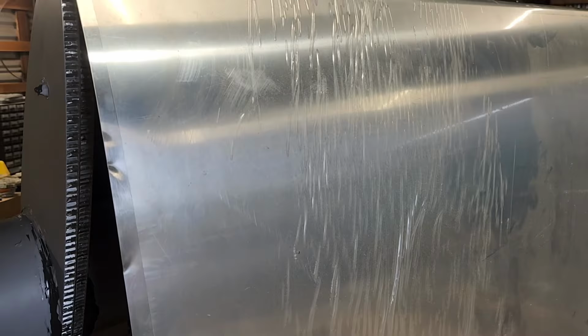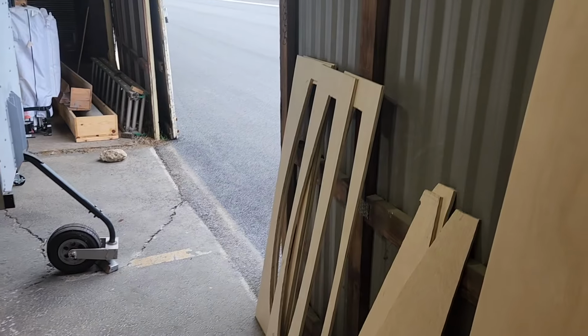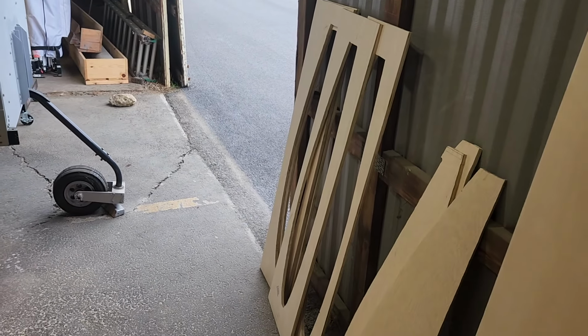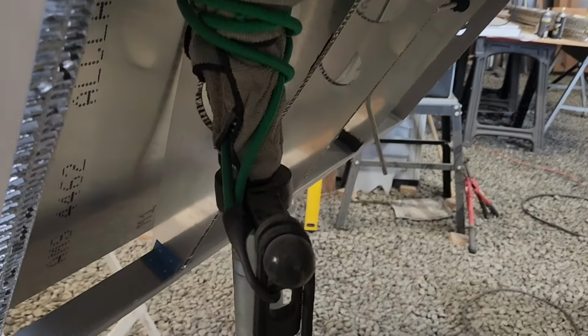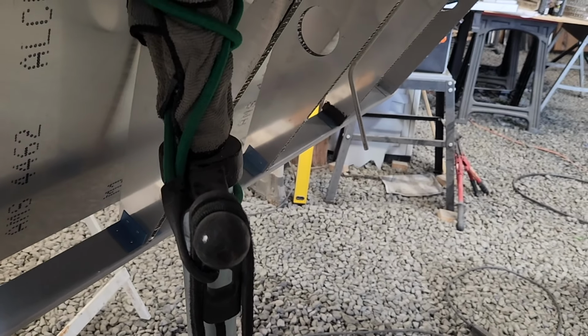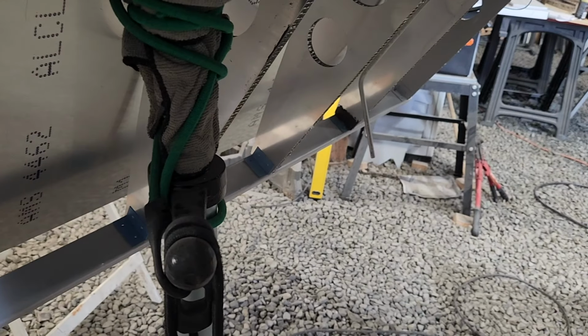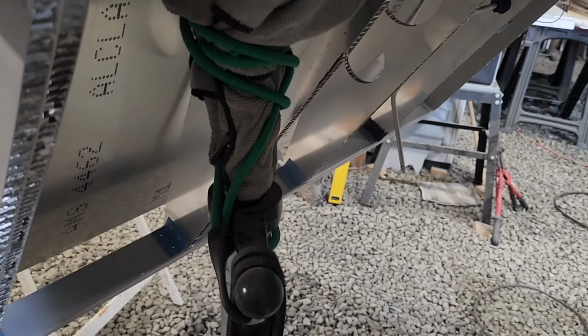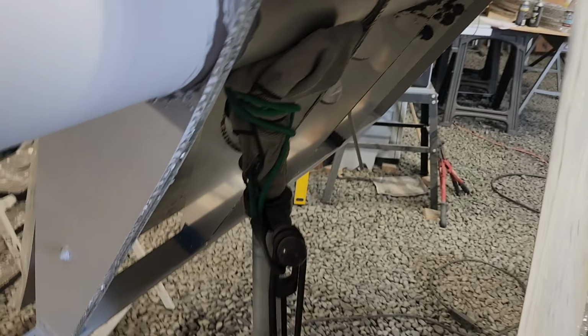So obviously I need to take all of that plastic off, which is not fun at all. So I've got four of those made. I still need to make one more. They need to be doubled up. What needs to be done under there, you can see that fuel line coming out. That's where it goes into the fuel bowls. That's the lowest possible point in the wing, because it'll all flow into that bowl. So you're guaranteed to get as much fuel as possible out of it, so that they hang underneath the wing over there. And there's one on each side, obviously.